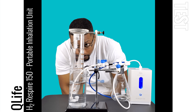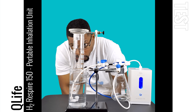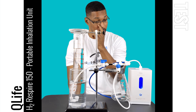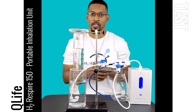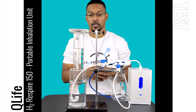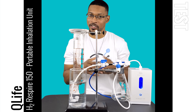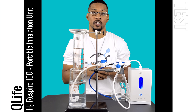The system is right at about 145 milliliters per minute, and that's about 140 milliliters per minute, which is pretty good. This is pretty much where the system normally sits. We normally conduct a number of tests and then get an average. On average, the system produces about 145 milliliters per minute at SATP. So it's pretty darn close to the claim of 150 milliliters per minute, and it definitely passes our performance standards for portable inhalation systems.